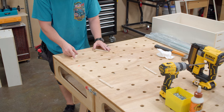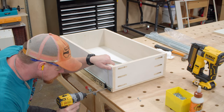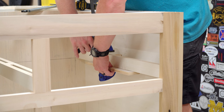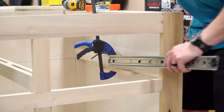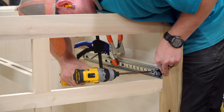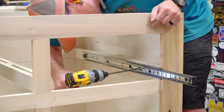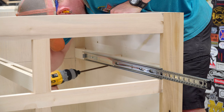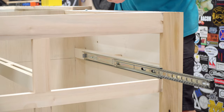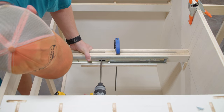It's time to install the drawer slides on the drawer. To start I use quarter inch thick spacers to elevate the drawer off of the work surface, so the drawer slides can be attached directly to the side of the drawer while the slides are resting on the work surface. To mount the drawer slide to the cabinet I start by clamping a block to the bottom of the drawer slide mount, then the slide can be inserted resting on the block and on the front face frame. A few screws will secure it. These economy full extension drawer slides are the best drawer slide value in my opinion — not quite as smooth as soft close Blum slides but also nowhere near as expensive, while still operating much better than cheap under-mount slides. The center slides are attached the exact same way, and a spring clamp is sometimes handy to hold the slide in place while you secure it.